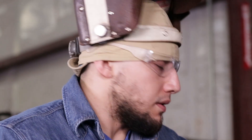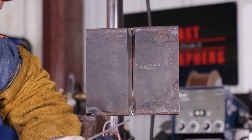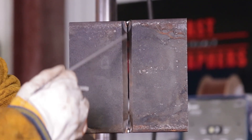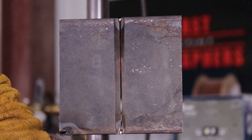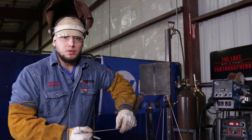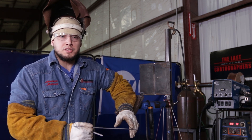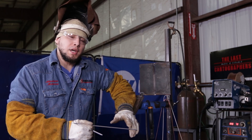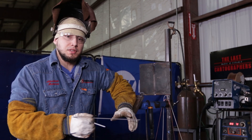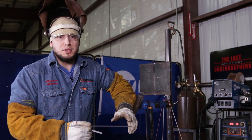I got my 3G coupon set up right here. I used a 3/32 landing and a 3/32 space gap, tacked at both edges. Now, if you want to use a 1/8 landing and a 1/8 gap, that's totally fine. Or a 1/8 landing and a 3/32 gap, that's totally fine too. But keep in mind, you don't want to go too heavy on your landing, because your landing could be a double-edged sword. If it's too thin, you can blow through easily. If it's too much, it's going to be hard to penetrate.